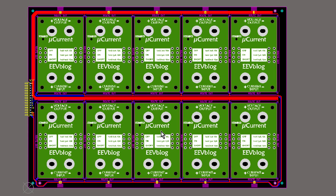Usually a panel is just a physical mounting frame with tooling holes to hold the board inside the pick and place machine and fiducials for visual alignment of the pick and place head. But we've actually added functional test infrastructure. If you wanted to, you could add active circuitry onto the panel. I haven't produced a separate schematic for this panel, but if you're doing it seriously with design rule checks, you'd typically have a schematic — both individual board schematics and a panel-level schematic.